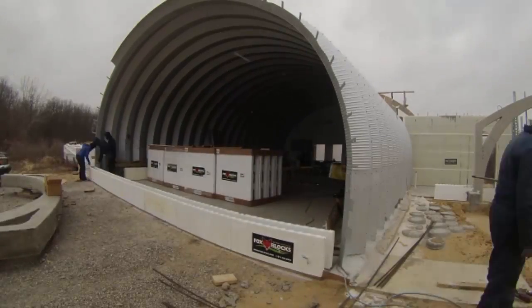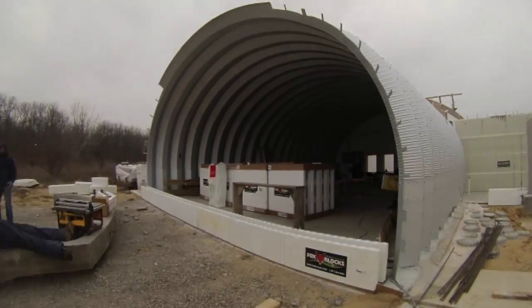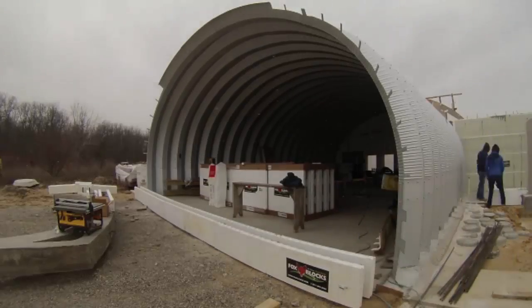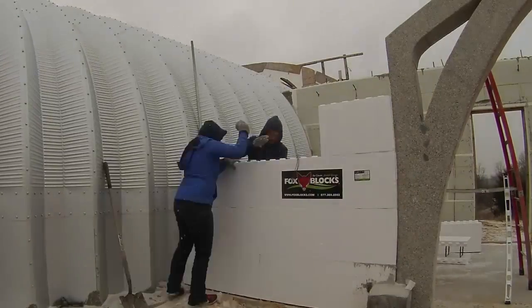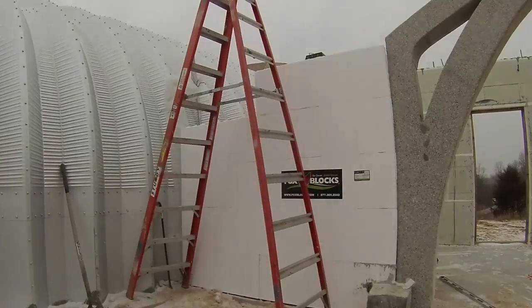Bonnie and my parents arrived to help with the south side blocks. We laid out a row to mark where the holes for the rebar needed to go. For the second mudroom wall, we also drilled and glued rebar into the concrete rib. Most of the stacking goes pretty easily, but sometimes you work too fast and need to back up a few steps. It's easy just to unclip and remove the blocks and then put them back later.